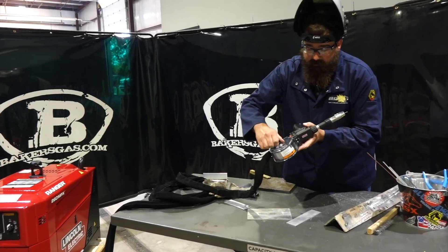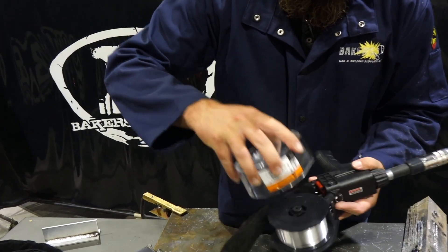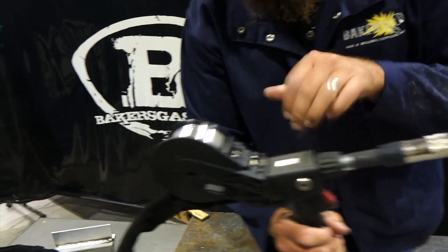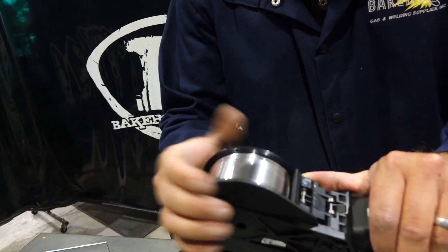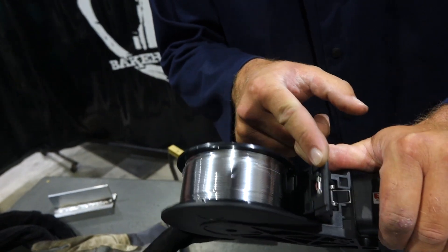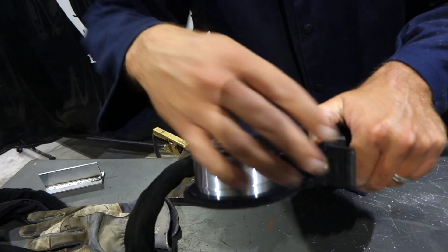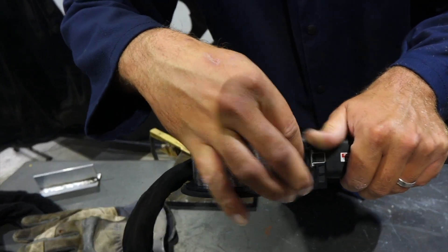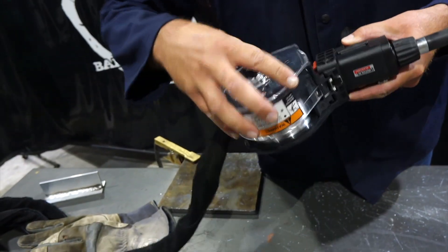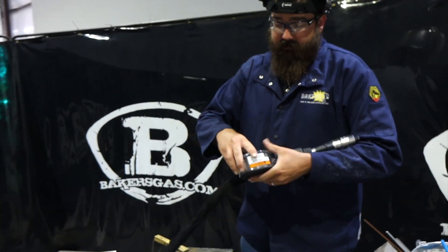Another unique thing I wanted to point out — it comes out here, that part comes off. It's almost like a brake for that spool gun. It keeps it pushed back and aligned, and when you're loading it, that thing pops up. Slide your spool in, feed your wire through here, and then flip that back down — it keeps it from free spooling. Very unique. It just goes back on there like that and you're all set to go.